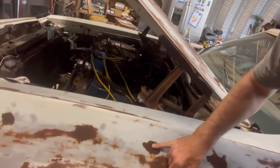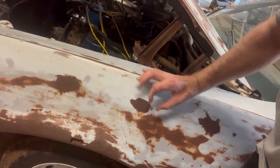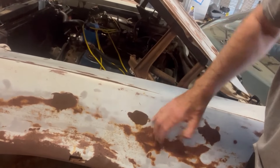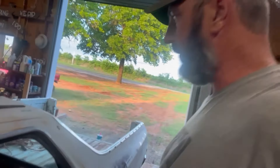Speaking of which, there may be a lot on this car. That little hole there is a lifesaver. Look up here — this one's already done. My brother did that when he had the car. What he did was get an eight-penny nail, turn it with the point sticking out, tack it in there, cut the nail off and grind it smooth — which is very smart if you've got the stuff laying around. I came across these circle patch plugs — I believe Speedway Motors has them, and possibly Summit Racing, which are really good too.